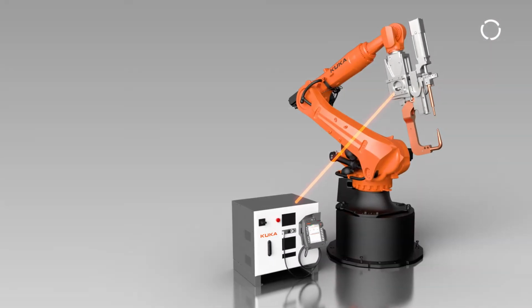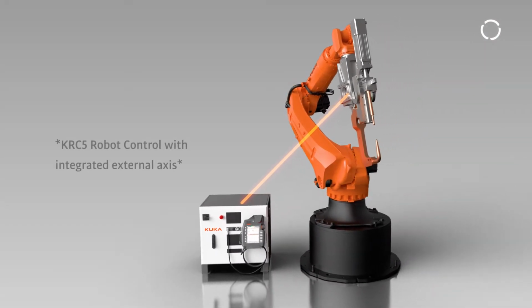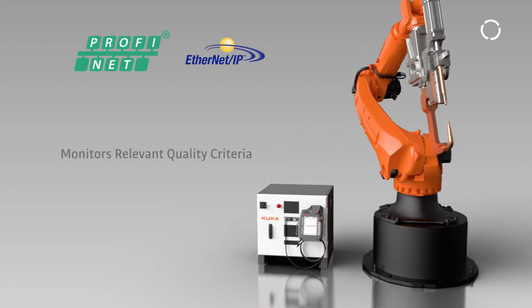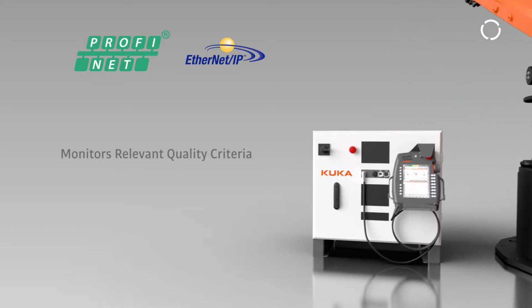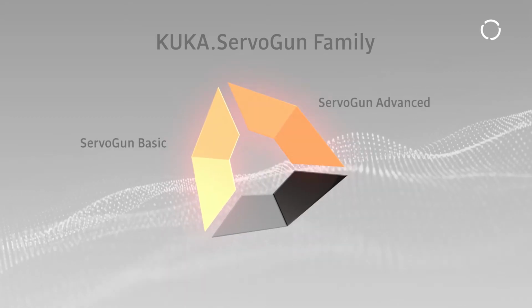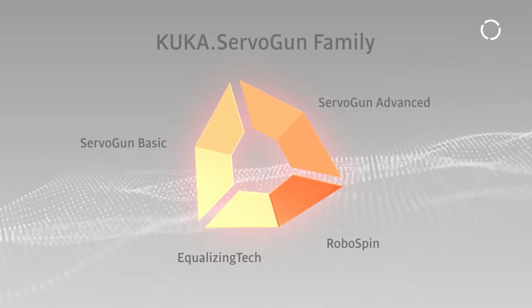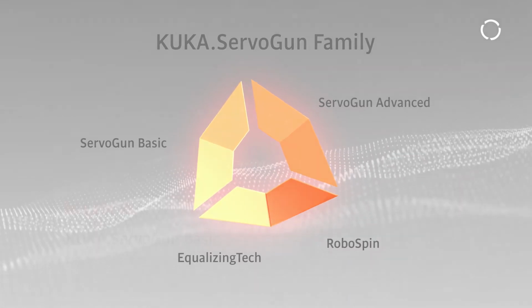KUKA ServoGun controls electric servo spot weld guns via an external robot axis. It communicates with the weld equipment and monitors relevant quality criteria, such as equipment errors, water and air states, and more. Our four flexible and cost-effective modules, ServoGun Basic, ServoGun Advanced, Equalizing Tech, and RoboSpin, allow an individual customizing of your robot system according to your special requirements.